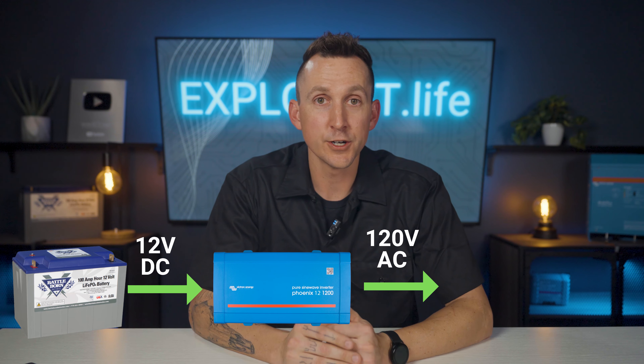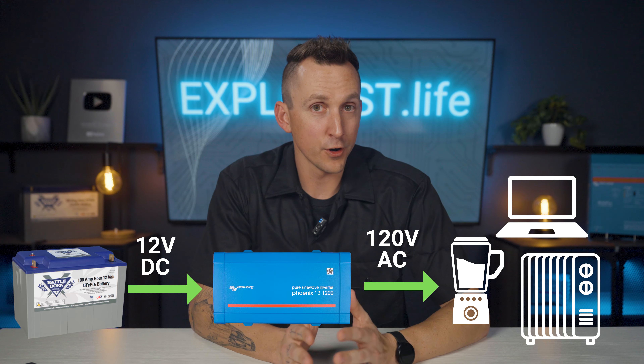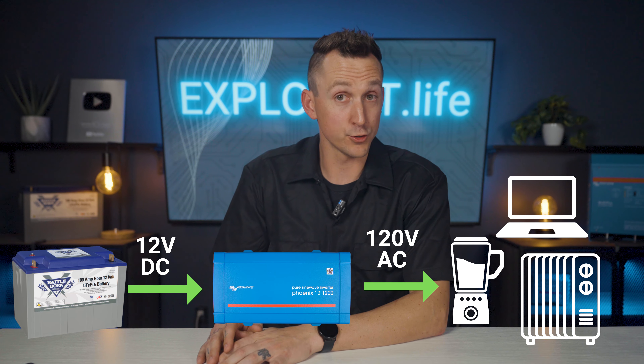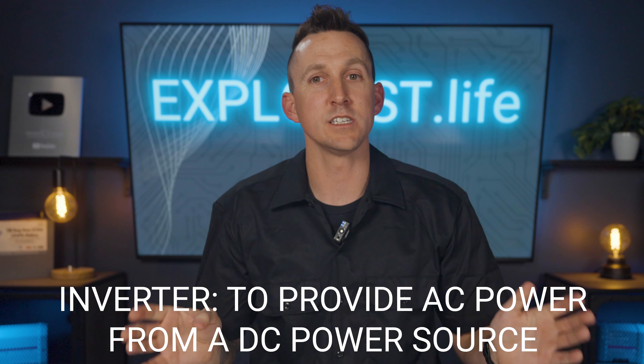What is an inverter? An inverter plays a critical role in any off-grid system. It converts the DC power stored in a battery to AC power, which is necessary to run standard household appliances. For instance, in countries with 120-volt AC grids, an inverter will transform the 12-volt DC, 24-volt DC, or 48-volt DC stored in the battery bank to 120-volt AC. In regions with 230-volt AC grid power, inverters are available to match those requirements as well. We can even provide three-phase power or split-phase power from an inverter. The essential function of an inverter is to provide AC power for standard household devices from DC power stored in a battery bank.